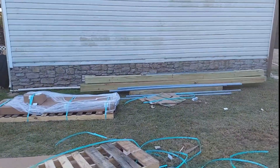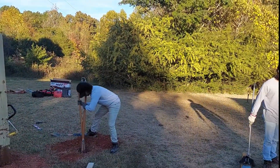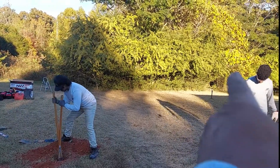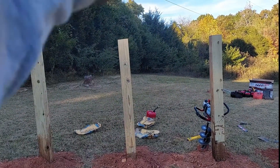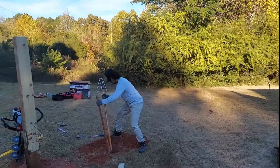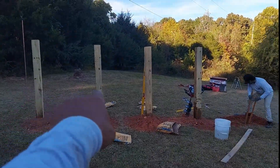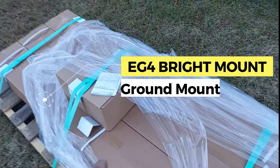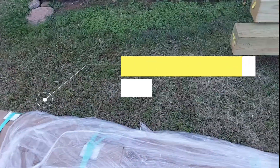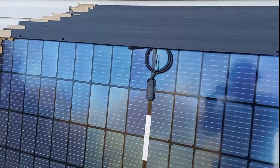There's lumber that we have to put across. We're putting three 16-foot pieces. We need to cut those posts, all 12 of them. This is going to be a stretch of 45 feet to where that shovel is. Each of these ground mount array structures are going to be 15 feet each — so 15, 15, and 15, that's 45. We have basically three 16-foot, six by six pieces cut to length. They sit on top of those posts. The EG4 bright mount system — there's three of them. Here are the 14 panels, and that's the specs.